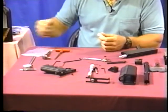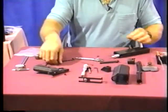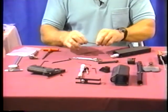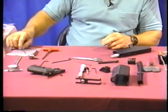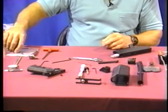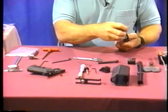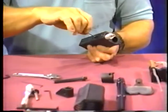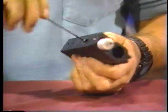Small amount. Okay, take the Allen wrench. Put the Allen on the cocking nut, and just barely roll the tip of it in there. You don't want a lot of Loctite on this area. If it runs off into the bolt assembly, then we both have a problem. You'll get mad at me and send the gun back because it won't move, because it's Loctite in place. You want the hammer assembly to move freely.